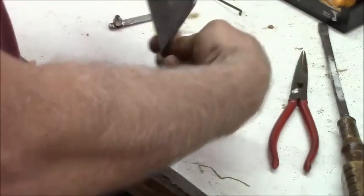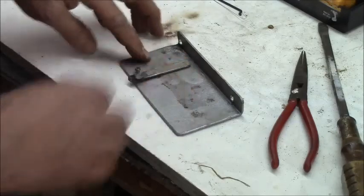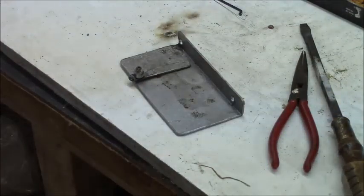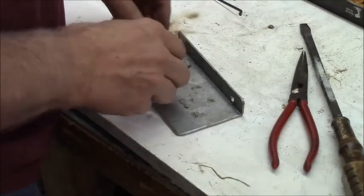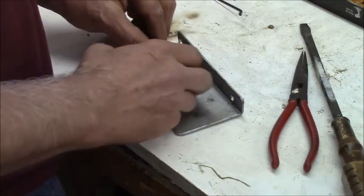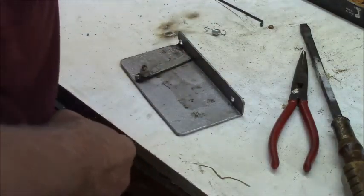And I wanted to bring it back this way far enough, because what I'm going to have to do is somewhere out here, I'm going to mount that return spring, which was used on the original go-kart throttle, and it might still be on the table. This is a pretty stout little spring, so I want to put a hole here somewhere and some sort of little tab that when I pull this, it pulls this return spring and sucks it back to the idle position.